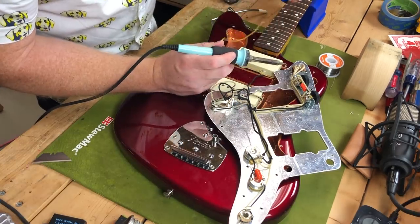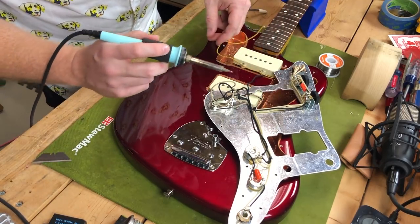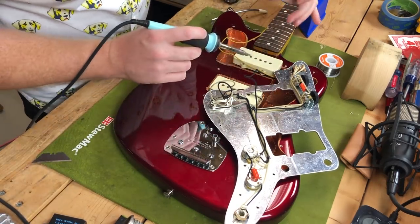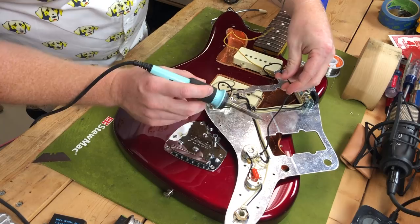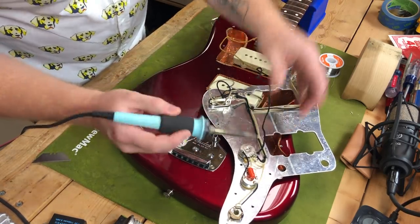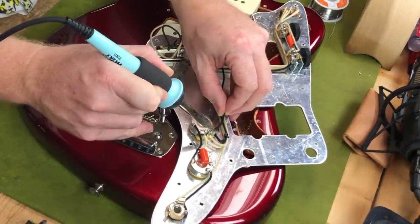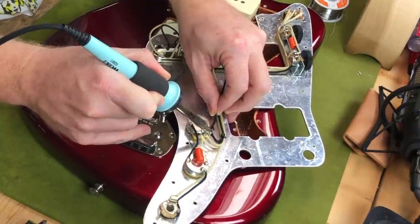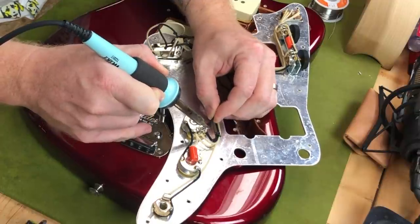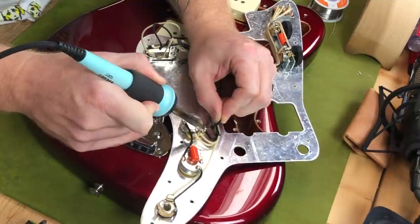All right, now that the hot lead of the neck pickup is off, we are going to move on to the ground. And here's another criticism I have of whoever did this. I'm sorry, this ground wire does not need to be quite this long. There are other places you can route this other than right here. Traditionally, it is a much better practice to route all of your ground connections to the same area, but it's also not a good idea to have a bunch of excess wire. Oh my god, everything this person did is like this, isn't it? Oh my god. Okay, don't...